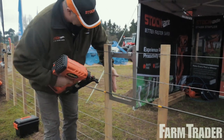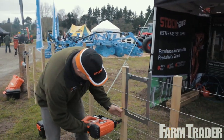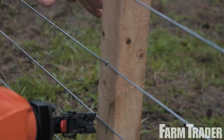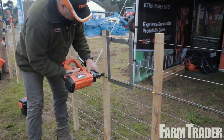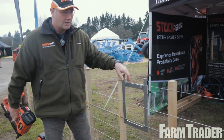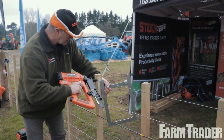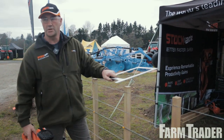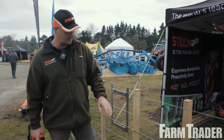The nose piece is your wire guide, so you locate onto the wire and staple on. Always use the top wire last to take the square off — that means your wire is not going to be saddled when you've finished your fence.